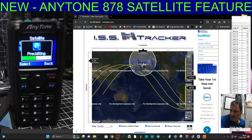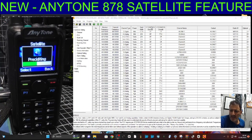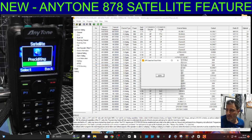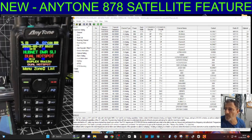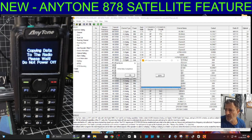I just watched a video by 2E0UKH - big thanks to Chris. He says make sure you've got the GPS turned on and the UTC time is correct - that's why mine was frozen. The Keps information is in Tools > Satellite Data Writing. Make sure your cable is connected. Go to Tools > Satellite, then write - and it's always very quick, same as with the GD77.